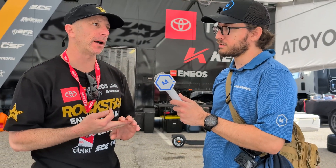My new favorite process is Multi Jet Fusion. We don't have that printer at our shop, but I'll upload the file and get the part made. We also do some metal printing — aluminum and Inconel — using laser powder bed fusion, similar to SLS. The 3D printing is critical; we almost don't have bad parts coming back from CNC anymore because we've already tested them. You get to check not just if it fits, but how you install it and whether it clears surrounding pipes and components. Thanks very much — great to meet you, and good luck in the first event.